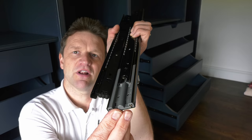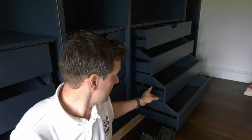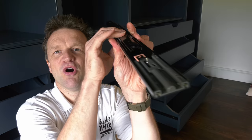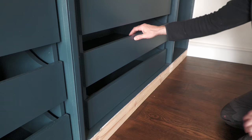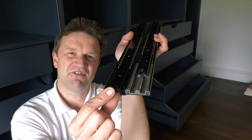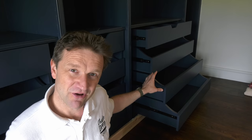This is the first project where I've had to use soft close runners because the standard runners were out of stock for all but the bottom drawers, which are narrower because of my chimney behind. My feedback on these soft close runners: personally I probably wouldn't use them again - I just find them too quirky. You've got to get your drawers bang on for the pin in the soft close mechanism to engage properly, you have to give the drawers a bit of a yank to pull them out, and the soft close mechanisms only have a 25 kilogram weight capacity whereas the standard ones have a 45 kilogram capacity. You can also get concealed drawer runners - more on that in my last video - but I love the simplicity of these for making really simply constructed drawers, and of course they're a lot cheaper than the concealed version.